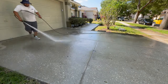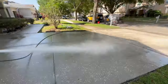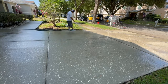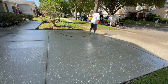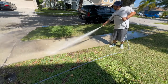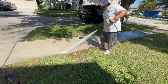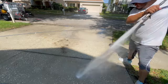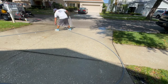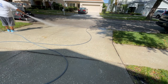Another tool you're going to need is a J-Rod. You always hear me talking about a J-Rod. This is basically a four-tip J-Rod and it's what we used at the beginning of the video to lay on your chemicals. If you need help with dilution and all that stuff, we have the free Facebook group Pressure Wash Community where you can get free tips. A J-Rod allows you to downstream chemicals onto the concrete and removes all the mold, mildew, and dirt. Then you use your surface cleaner and finish up with the ball valve. It's also a house washing tool as well as for pre-treating.